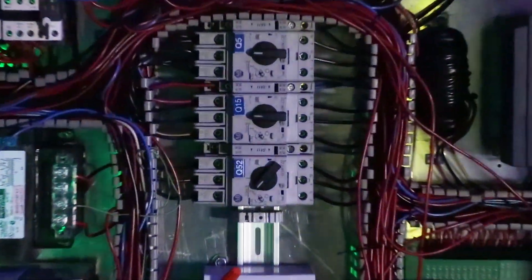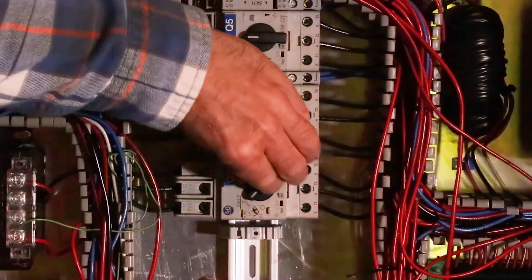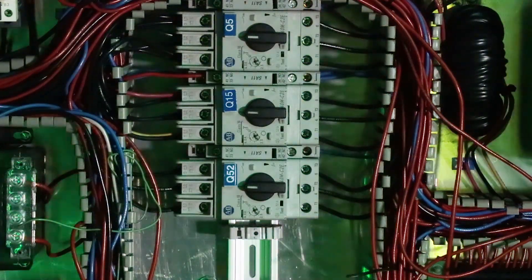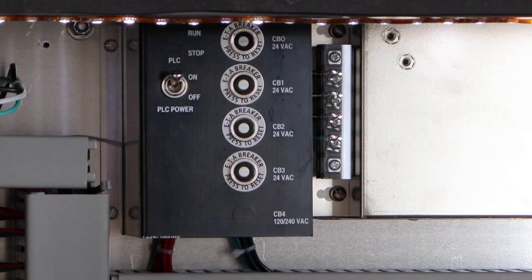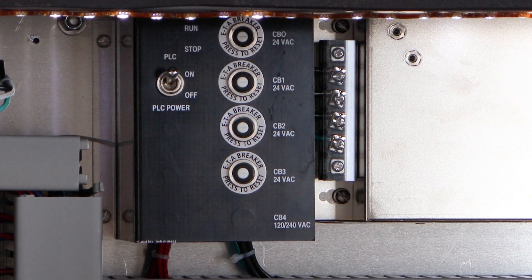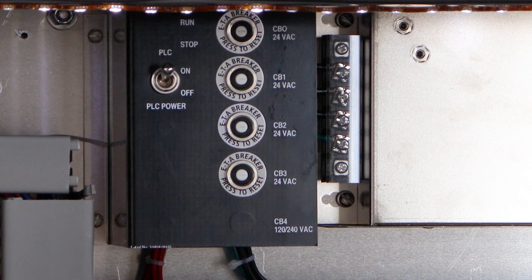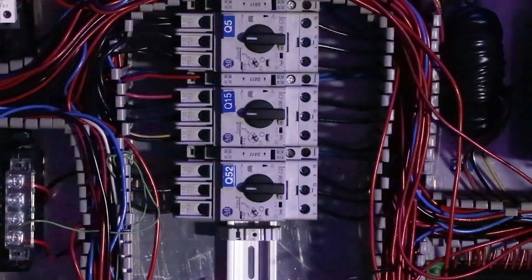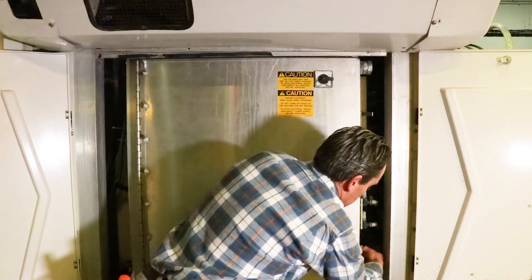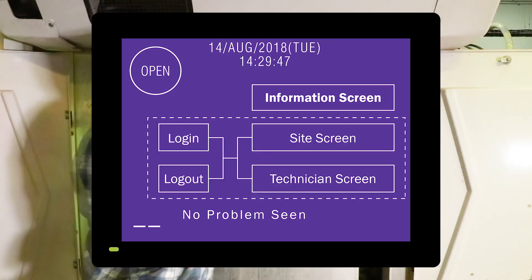To identify a tripped overload, you will see a switch in a 45-degree slanted position. Reset the circuit by turning the switch to off and then back on — they should all be going in the same direction now. There is also another style of circuit that has white buttons that will pop out when they are tripped; to reset these, just push them in for a few seconds to see if they stay in. If the circuits continue to trip, call for service. Close the cover and relatch the top and bottom latches to make sure it's watertight, then turn on the power switch and see if the error code is cleared on the HMI.